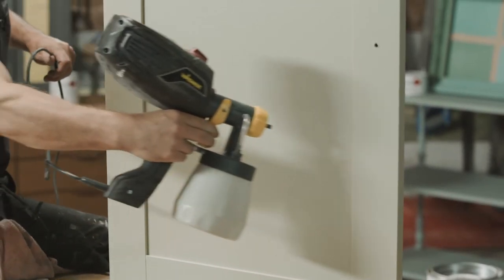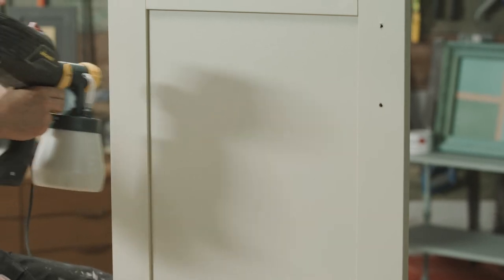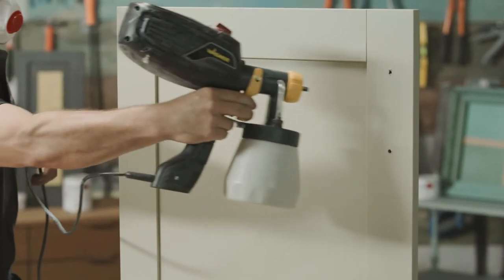The Lazy Range is touch-dry and recoatable in one hour. Do not bring soft furnishings in contact with the newly painted surfaces for 48 hours. On areas subject to wear, we recommend a three-week curing time before heavy use.